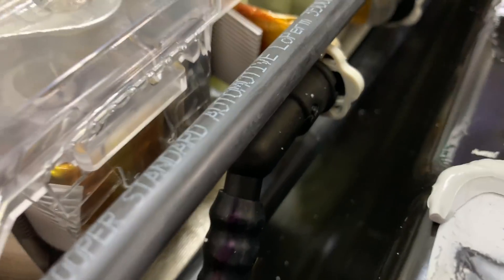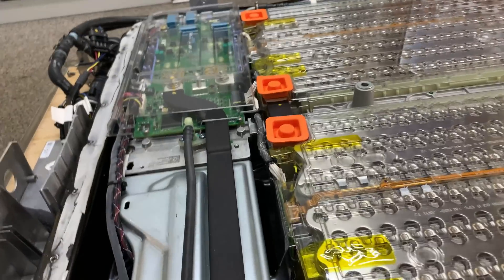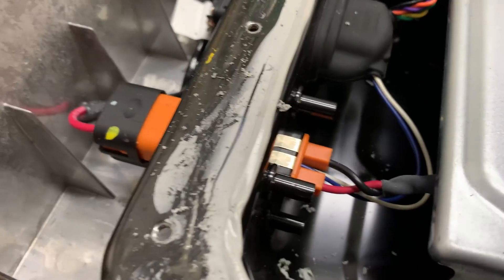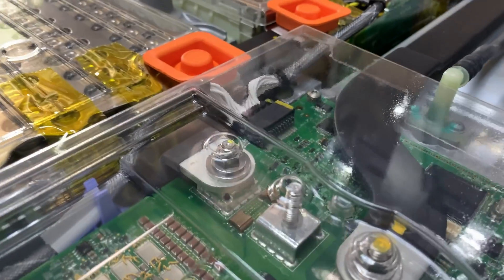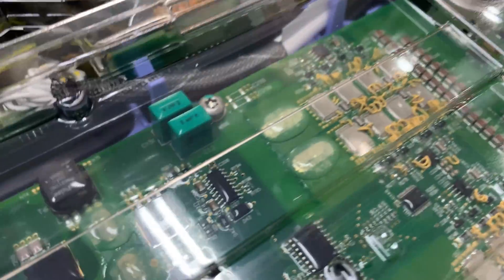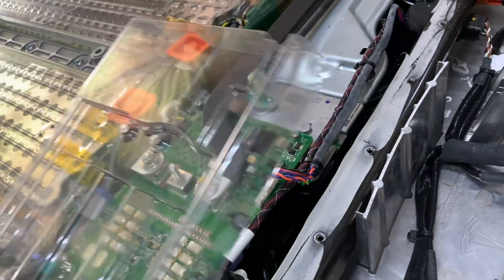We've got coolant lines — a coolant line coming in on that side, a coolant line coming down in here, and what must be a reservoir of some description down there. Under here we've got bus bars. The first thing to do is work out whether we've got any voltage, just for safety's sake. It's interesting that one connector there has a third wire going to it — perhaps that's an earth, or maybe an indication of the plug being plugged in. We've got some decent-sized bus bars, balance leads coming in, and the board looks like it's conformally coated.